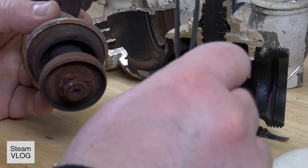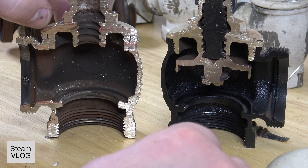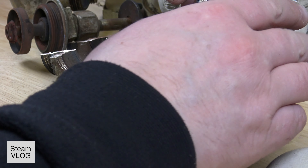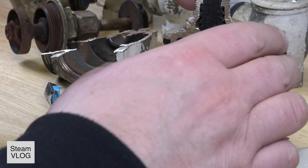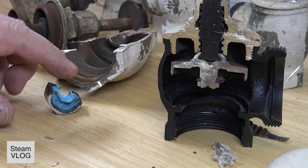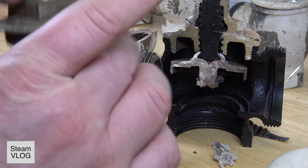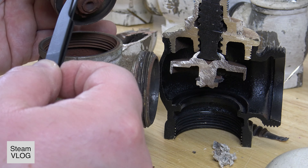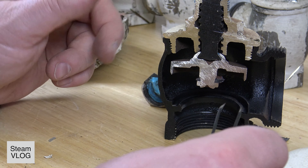If this nut comes off, you could take the stem out all the way when you remove the packing nut. So if you replace the packing nut — this nut here — you could place new packing into the nut, but you still can't take the stem out all the way. What you have to do is remove this upper part from the valve — this top part is screwed in, you can screw it off, open it up, look inside. If the seat is still intact, then you're good — you put it back together.